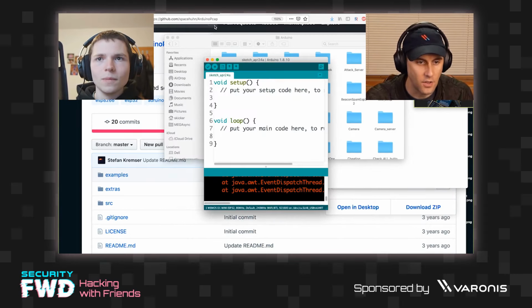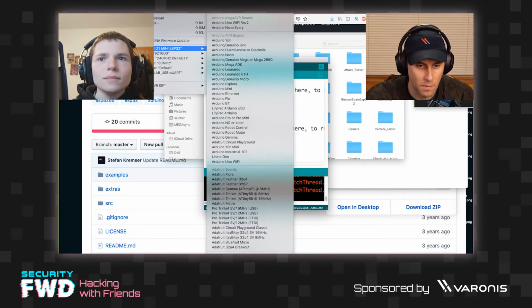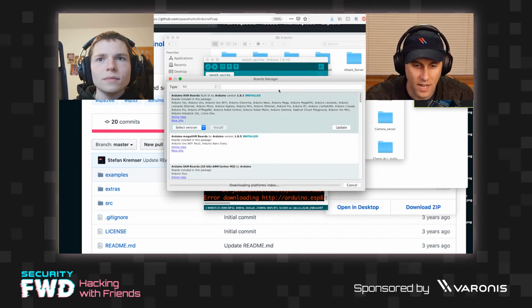of it. You can go to then Tools, and when it eventually loads, we can go to our board manager and select an ESP32. Basically, we'll install the ESP32 boards, and then from that, we can select which one we have. And this is pretty important, because if you don't select the correct board, it will not work. When I flashed this to the wrong board, I got a brownout warning every time I tried to use it. So it's really important to select the right one.